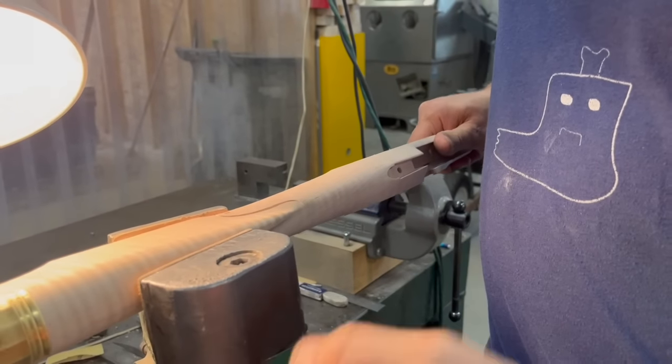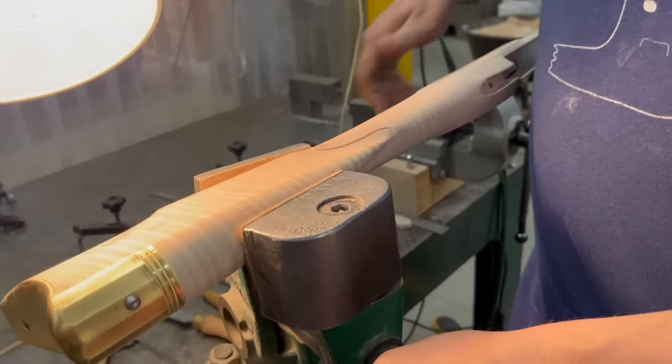Moving the light, I don't think it looks too bad. I'll hit it with a little Scotch-Brite — it's just abrasive fabric. That looks pretty good. There are a few remnants where you can tell it's been chisel-cut, but no gouges or anything, so it looks good. Now we're going to come up here and relieve this comb. Because of where the grain is, I'm going to have to start here and work down, taking it back just a little bit so I can blend it in.